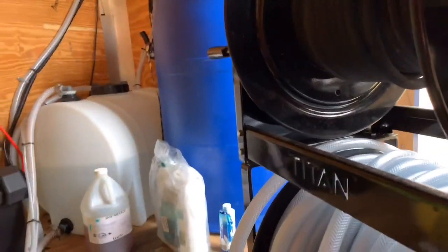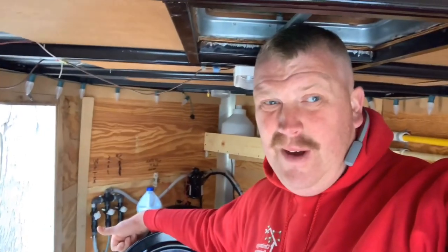That is sodium hypochlorite, and that is where I get my mix. My mix is usually 50/50 — 50% water and 50% sodium hypochlorite at 12%, which brings me down to a 6% mix. If I need to go stronger, I'll pull my roof pump out. The only reason I'd need to go stronger is for stucco or roof cleaning — obviously for roof cleaning you're going to have to go with the roof pump.